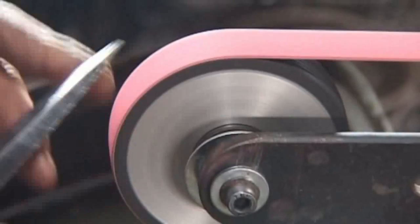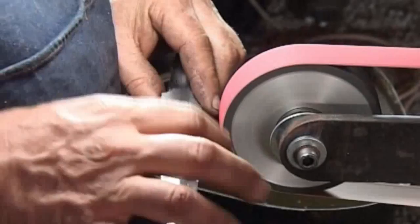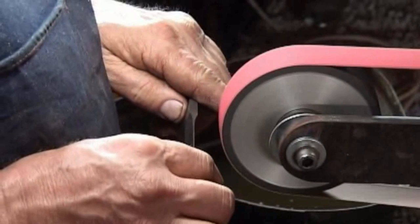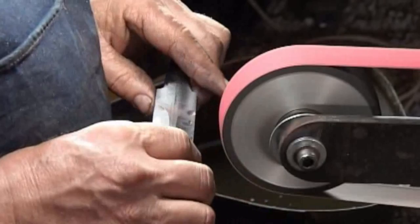We'll do that. All right, now I'm going to start working at the plunge lines. Now, this is where any collector who knows what he's looking at is going to evaluate your work. And you want to make sure that it's as good as it can be there. Now, what I'll do is the hand that holds the handle, I'm going to just very lightly run the index finger up against the inside of the wheel, and that's going to give me extra stability to just reference off the wheel so that I don't land up taking a great big old bite out.